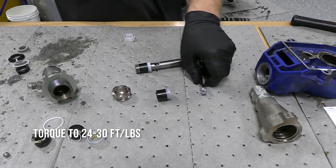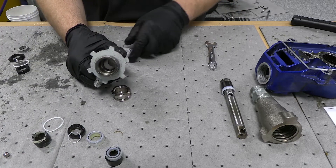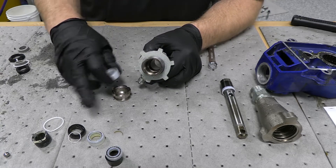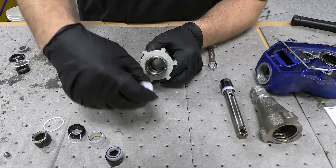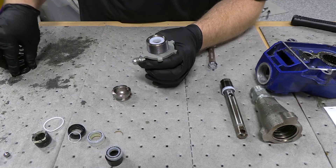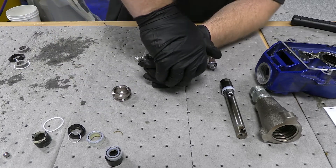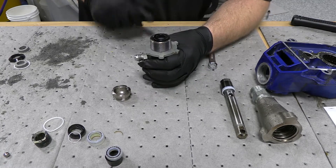Tighten that down, that piece is ready. Now we have to assemble the top half of our pump. This all kind of came out in one big piece, but the springs go down inside of there. So very carefully get it started and get it started off square, then you've got the spacer that's going to go on top of that and you can use that to push that down and get that piece started in there.